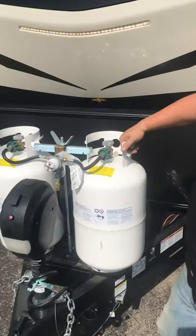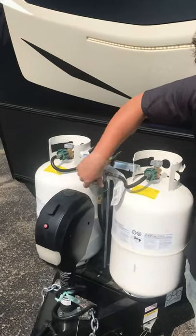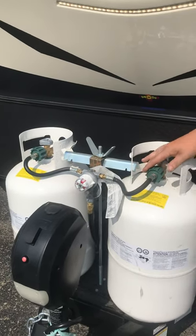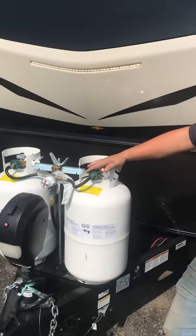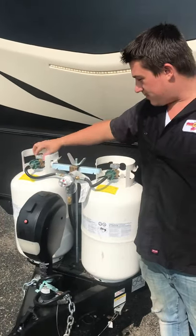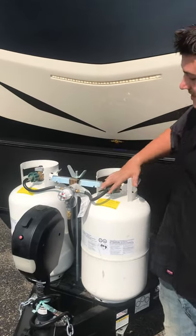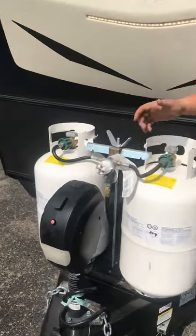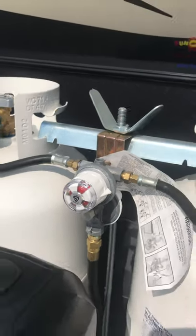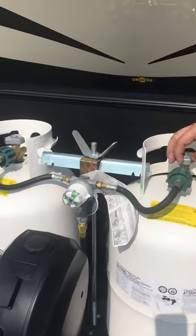Your two 30-pound tanks are full here. There's also a tank selector on the regulator. There's a little pointer to select which tank you want to use primarily — it only selects one tank at a time. It is auto switchover capable: if you open both tank valves, it will switch over automatically once the selected tank runs empty. Inside the selector lens, there's a red or green pressure-based indicator — red means off or empty, green means it's on and full.